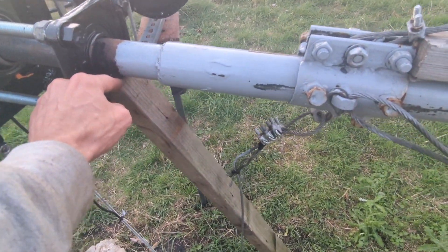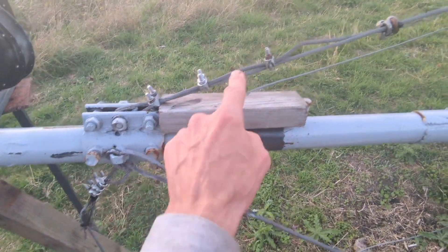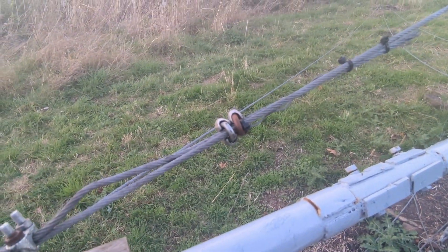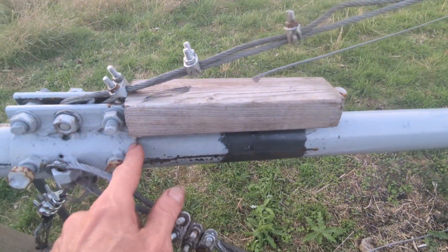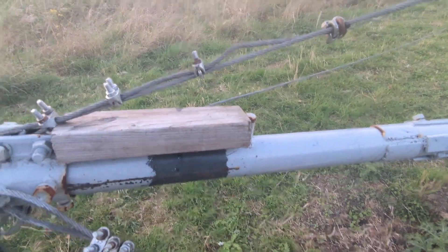What I've done is leaned the turbine on something and then I've got to let the tension off, because at the moment, even though it's got that thing there, there's still a lot of tension on here. So I'm just going to let the winch down to get enough room on the cable here to knock it off without having to undo all those things.